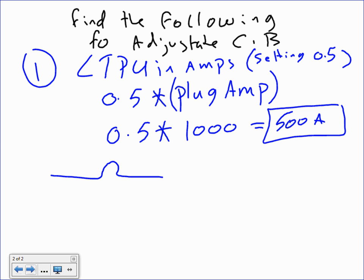So here's just to give you an idea. Now this circuit breaker has a 3200 amp, and it has also a 1000 amp, and it's set at 500 amp, right? Now my question, look how many amps this has. Which amp would you use to size the cable for it? The 500. That's the most important thing about the pickup.